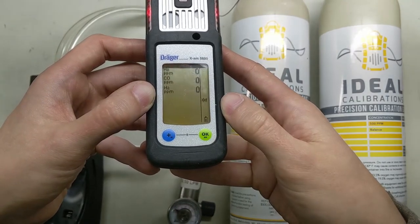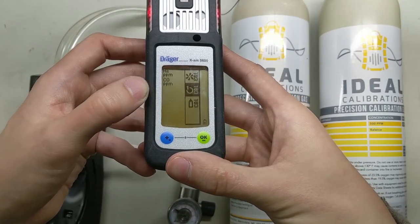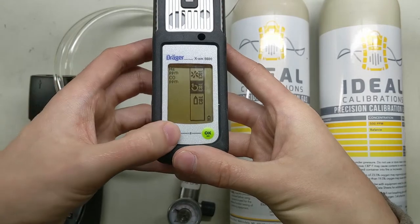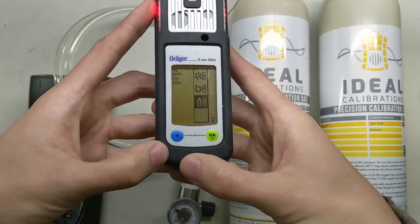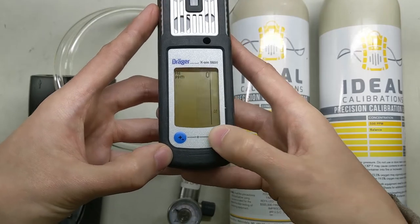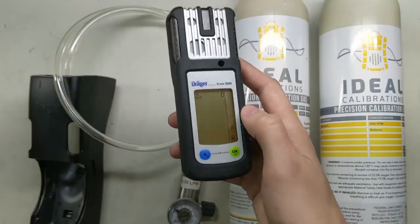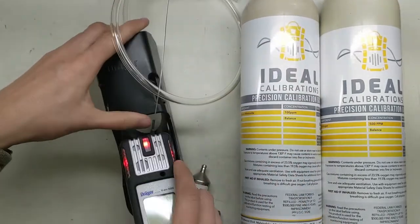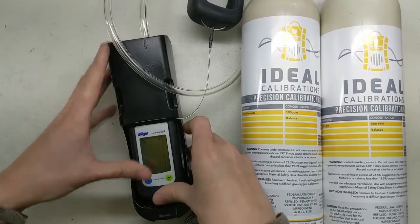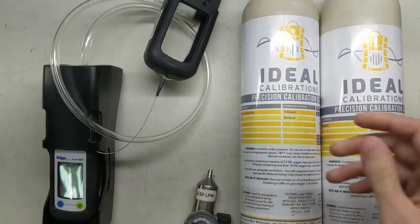Press OK. Now it's going to go through — you don't have to press any button here. It gives you the option of a 1-cal or a full cal; let's go down and select the full calibration. Increment using this button and hit OK. It's going to tell us what sensor we're doing first — looks like we're doing hydrogen. Let's get that out of the way first. Go ahead and slide this into the cradle and push it down — it'll make that click sound and that's how you know you did it right.